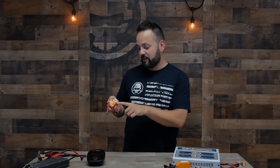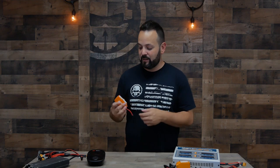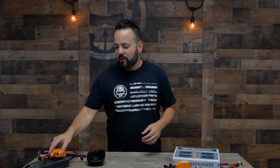Don't confuse the charge rating with the discharge rating. On this one it says 120C — don't charge this at 120 amps, that's not how that works. That rating is the discharge rating, saying this battery is capable of pushing out 120 times its capacity. Some batteries will have the recommended charge rate printed on them, some won't. The basic rule is: if you're not in a rush, charge your batteries at 1C. Take the capacity, move the decimal, charge at that rate.